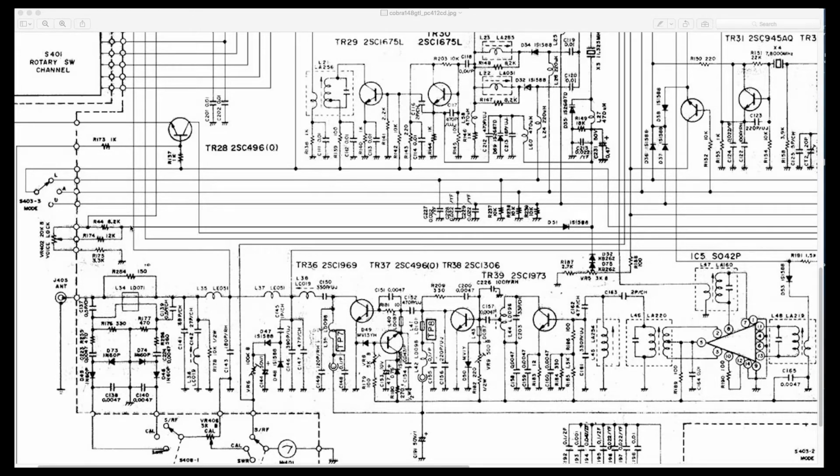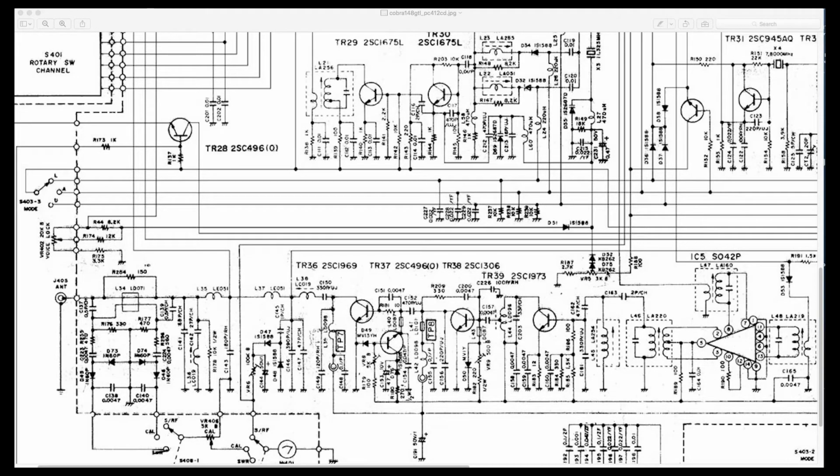Okay, and over here we have D75. I have to restore that. VR5, I have to restore that. R187 and R188. Okay, so those are the parts I had to refit in order to restore the Clarifier function. It is working. I've already tested it. I'm just going through the calibration part now, but I'm not going to bother videoing that. So yeah, that's working again now.